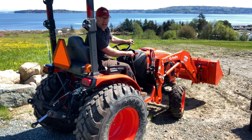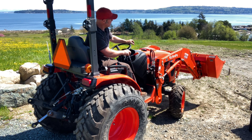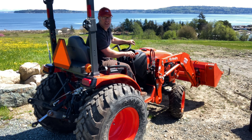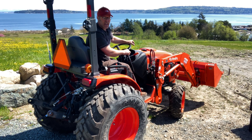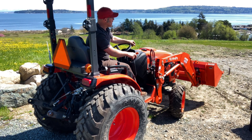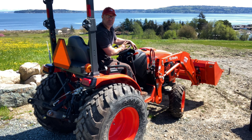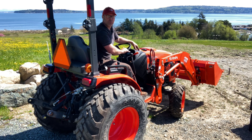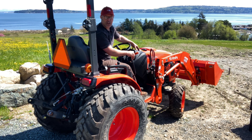Starting with the knob out, I've got totally normal loader function - lift and dump. When I'm ready to run the hydraulic top, push in on the knob and now right and left is going to control that hydraulic top link and I still have my lift function. Some customers really like to keep the hydraulic lift function in the front - if you're mowing and want to be able to run the loader against the ground looking for objects, and then right and left running your hydraulic top link, you've got options. You can always swap it later.